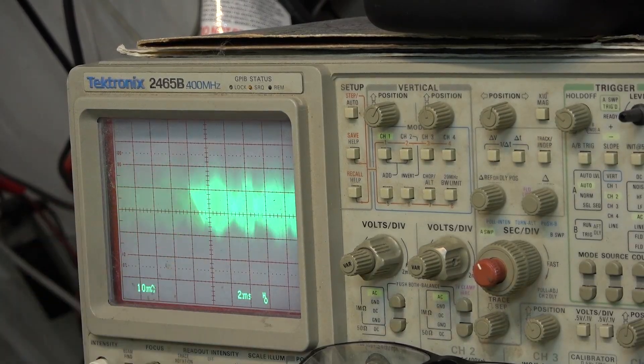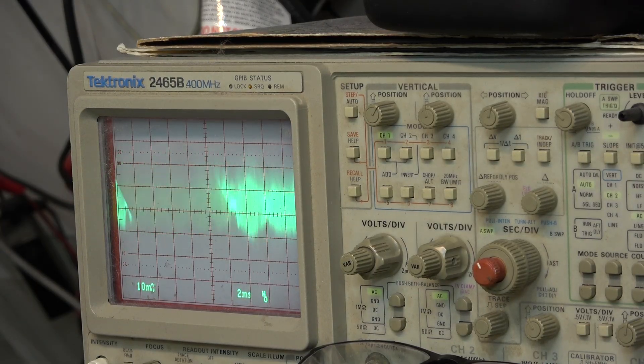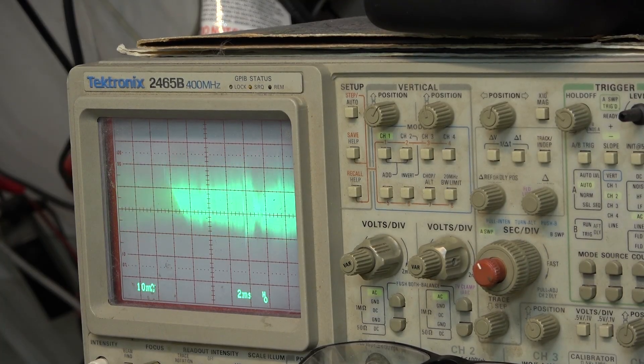You can see the lines here. If I tweak the guides, let's just see whether I'm able to clear this picture up and make it play perfect in fast forward. It's not really a useful feature, but we're going to do it just because I've got to see if it'll work. I'll start by adjusting the P3 guide, which is the exit guide.